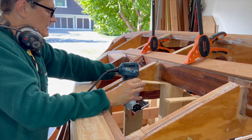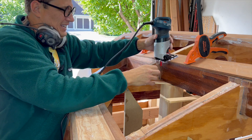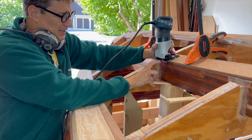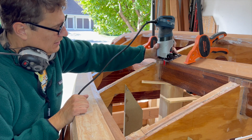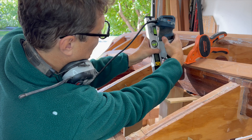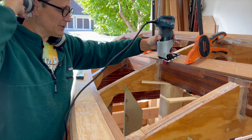What I did here is I mounted a guide board to the top of the stringer and using a compact router — I think they're called mini or compact routers — it has a guide bit so the guide will run along the guide rail up here. It should cut flush. I've already leveled this so it's straight up and down, and now I'm going to go ahead and route it.